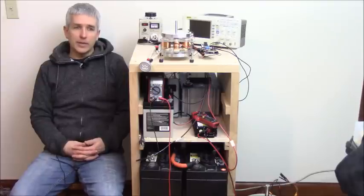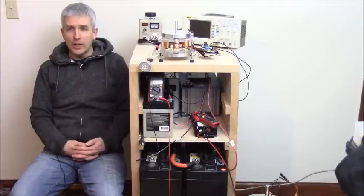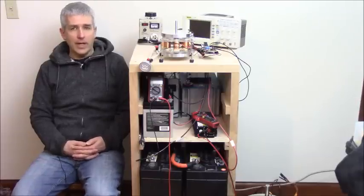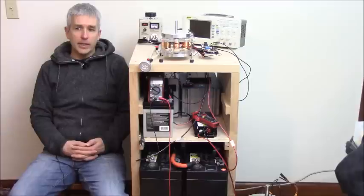So this means that you don't have to continue to charge with constant current, and you have an advantage when you're doing a negatively charged system. The positive charging is not advantageous for the battery, but every time you pulse a battery, you're giving it some negative charge, and that's where it's getting its benefit from, either in rejuvenation or in gains in capacity because of the pulse. So there's a negative preceding the positive current flow.